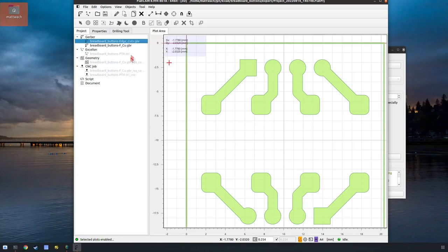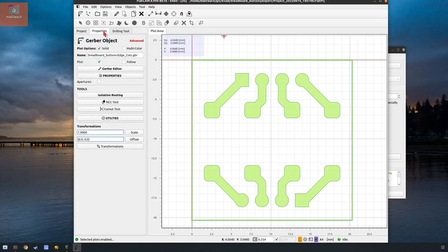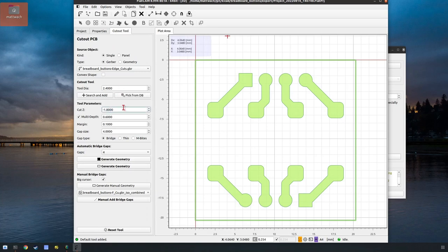Let's make the edge cuts. We'll do the final edge cut region and cut around the outside. Pick Edge Cuts, properties, and in this case we want the cutout tool. The cut depth — negative 1.7, otherwise it might make a little groove in my table. Multi-depth — this makes the cut in multiple passes instead of one, and that's how deep it cuts per pass. You want this because otherwise you might be taking on too much load on your bit. This is how much margin to make around the outside, and this is how big your bridges are going to be. We're not going to use bridges because I'm going to use a tape-down method. Tool diameter — anywhere between 2 and 3mm.